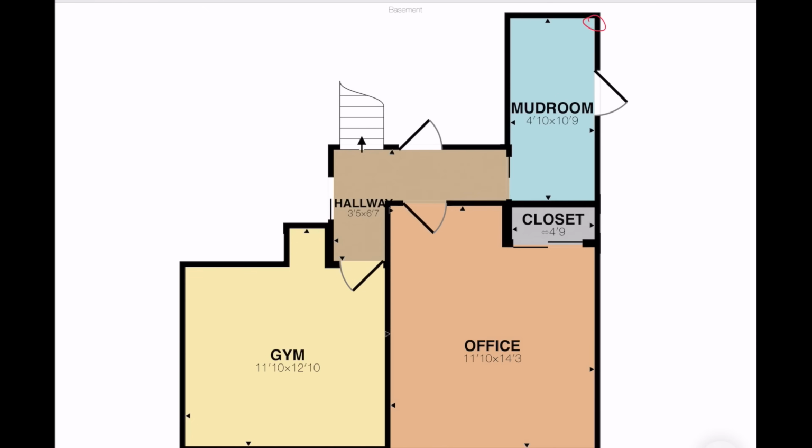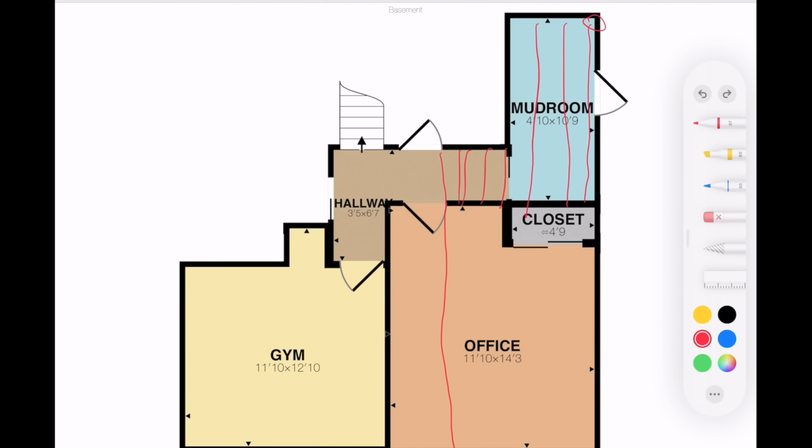If we were to start here in this mudroom, we're going to install flooring here, then here, then here, work our way down till we get to this doorway. Then we'll install a board that goes all the way here. But all of this area has not been installed. So now we're going to have to lay boards and work our way backwards up here. The other option is you start laying another board here and hope that these are the exact same size and that by the time you end up here, this board connects, which is very dangerous, and a lot of times, I mean, even if you're off by a 1/16 of an inch, it's going to make a big difference. This wall might not be perfectly straight. It's just really difficult.